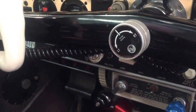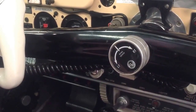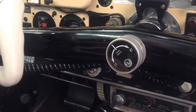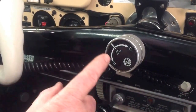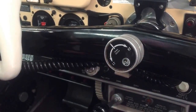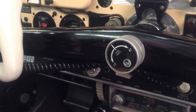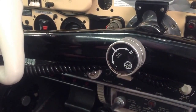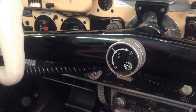The reason I don't leave it in that position is that as the weight and balance changes it may need readjusting. If I leave it like that and get weight on the left side, the roll servo in the autopilot is constantly trying to put in roll-right to counteract left tendency, fighting against the spring putting left-hand roll tension into the aileron system. Having just spent on a new roll servo for the autopilot, I'm very keen to put as little stress on it as possible.